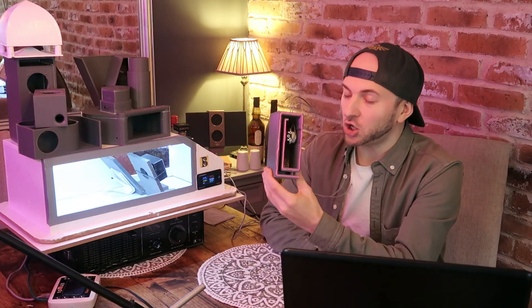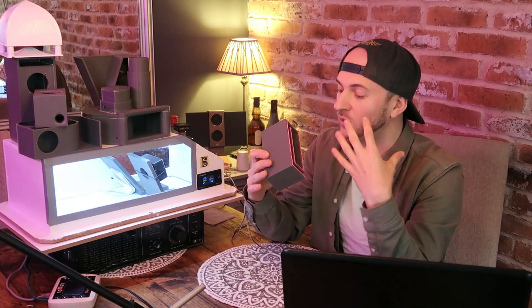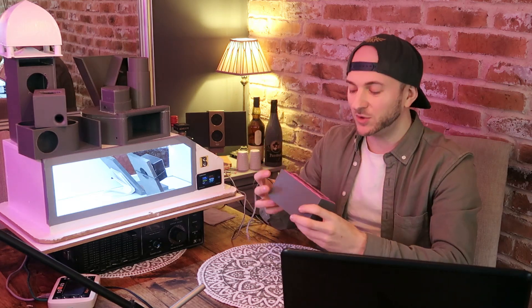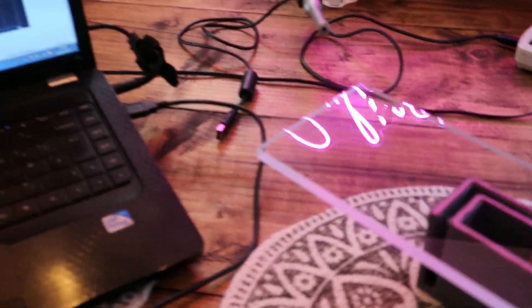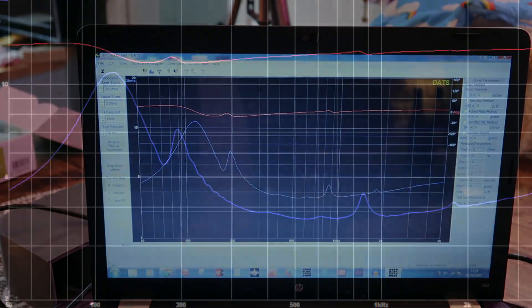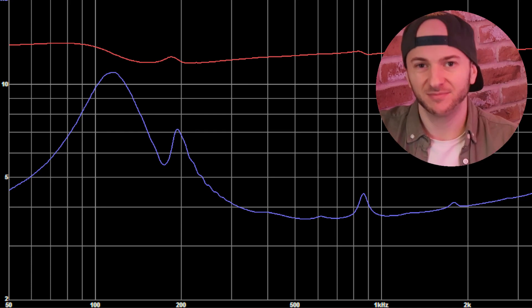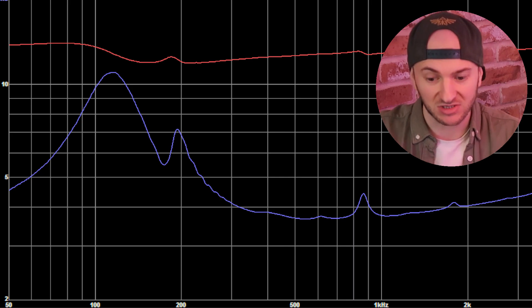Now that's out of the way, let's drop a top on this. I'm going to put a Perspex top on it to start with, just so we can see the woofer moving while I do some analysis. Then I'll put the 3D printed final top on when we do the testing. I'm very curious to see what the impedance sweep looks like. The good news is it has an impedance dip with two spikes either side of it, lending to the fact that it may have a Helmholtz mode that's actually going to do something here.